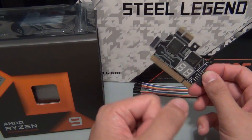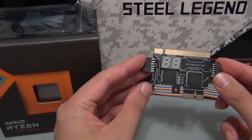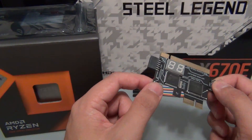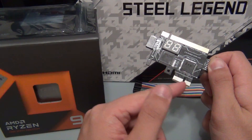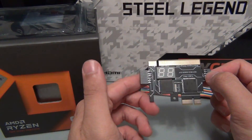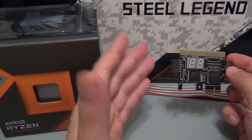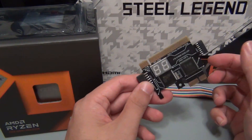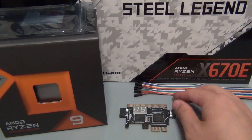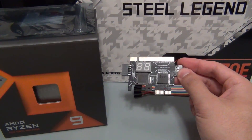I hope you found this video useful. Let me know in the comments if you've used a debug analyzer for motherboards like this, and if you use it on a Gigabyte motherboard, let me know which one and how you get it to work. Plugging into PCIe X1 is supposedly all you need, but Gigabyte on the X670 I tested doesn't display anything. ASRock works with the UART-1 interface, ASUS works with the TPM interface, and I haven't tested MSI yet but they have a J-something interface. The link to the debug card is in the description — it's not too expensive. I'll catch you guys in the next one.